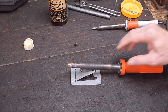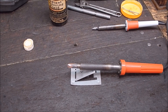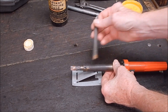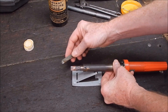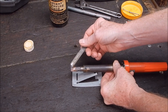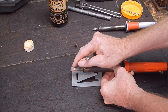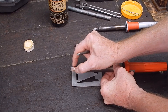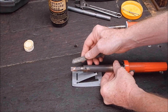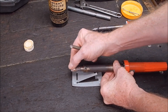The next part of the process is that you heat up the iron and apply the solder in a good quantity. Wire solder is not really great — what you should use is stick solder. If you've got stick solder you can really flood the solder on. There's another way using wire solder: wind it around the tip where you want to do the tinning. You can do it either way, but in both cases you have to heat up the iron in the correct fashion.